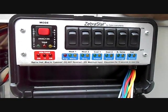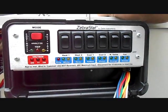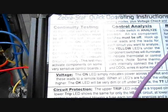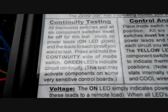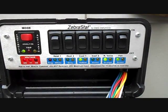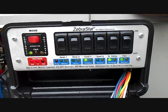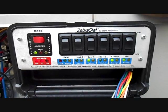What the continuity setting tells us is if those circuits are good and complete. Let's say you got a wire missing, came off, or was unwired — it would show as not complete. So if we switch it to continuity, we'll see that all three of those circuits are good. A green light will show whenever it has continuity, so you can quickly check several circuits at one time. You can know real fast if you have a problem without having to go one by one.